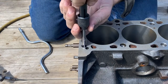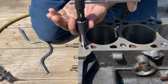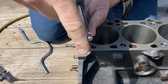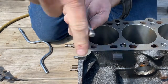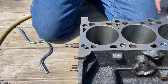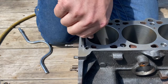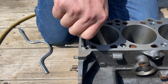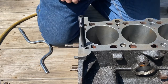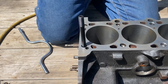I'm going to run this down one more time. There — I'm done. The stud should be able to wiggle just a tiny little bit so that it can self-align on the threads when it's torqued. That hole's done.